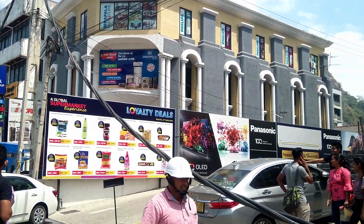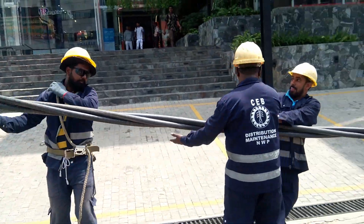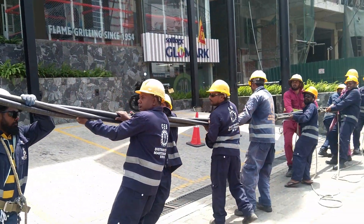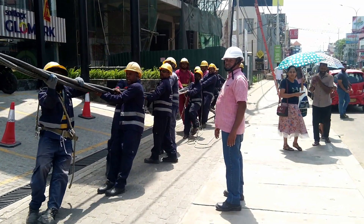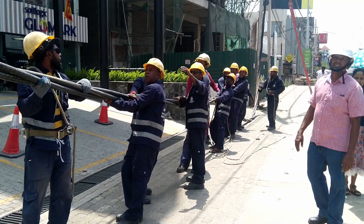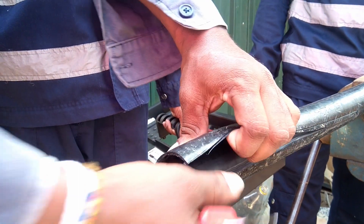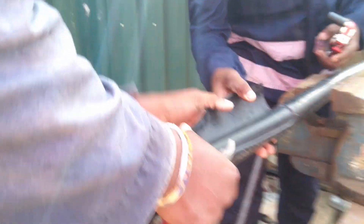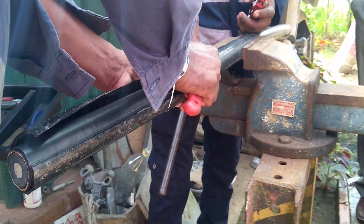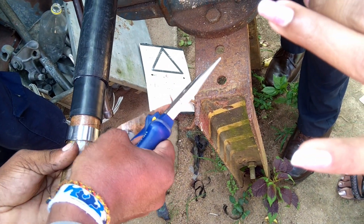Fully insulated overhead conductors, famously known as aerial bundle conductors, is a solution which lies between the pros and cons of conventional methods. Medium-voltage bundled conductors may be the heaviest among all overhead conductors. Manufacturing of a single-phase conductor is very much similar to that of an underground cable. Primary insulation is provided with cross-linked polyethylene, with copper strips on top and outer sheets for providing additional protection.